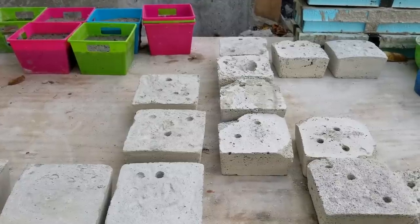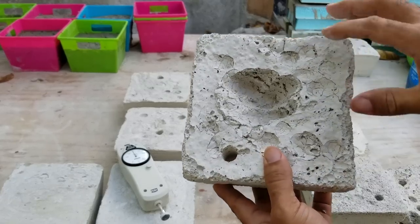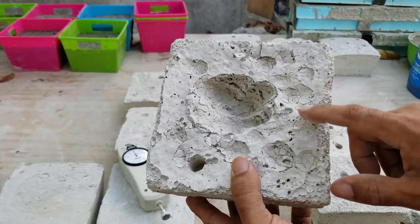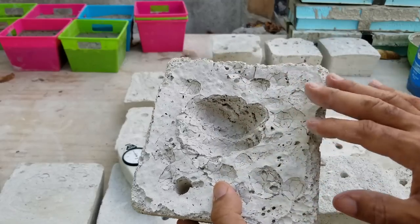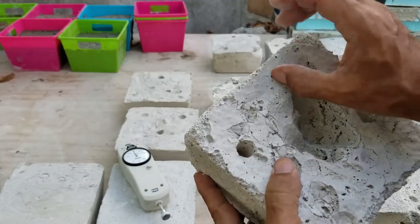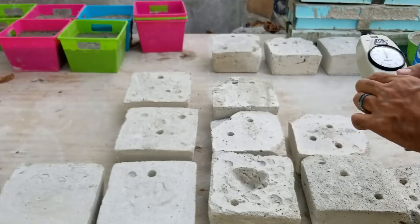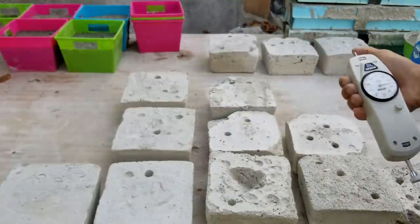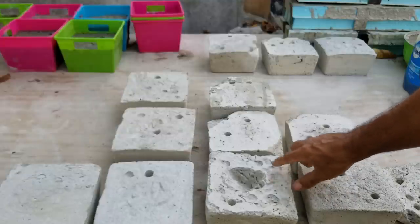Next we have our J-lube and baking powder mix. When I first did the test, this was the only sample that took longer to cure — the next day all the other samples were pretty much firm but this one was still super soft as if I'd just poured it. But the following days the skin got really hard and it turned into a really hard sample. At 125 pounds it just made a little impression on the surface — that's a big increase in strength from the first few days.